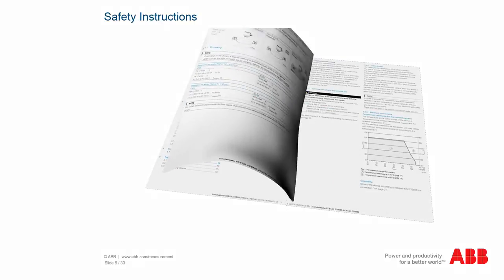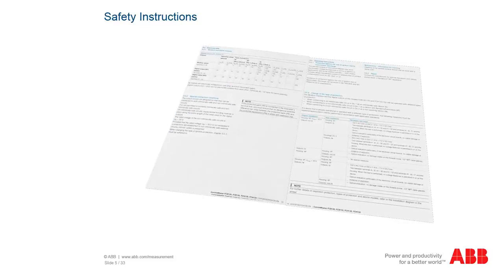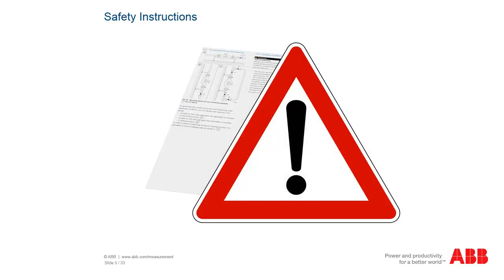The replacement of any parts of 4-wire measuring systems approved for hazardous areas requires extra care. Inadequate handling of the replacement will endanger the health and safety of any personnel involved and will endanger safe operation of the installation. Depending on the approval, 4-wire measuring systems are protected by applying intrinsic safe circuits, potting and explosion-proof housings. All of these protection methods have to be secured.